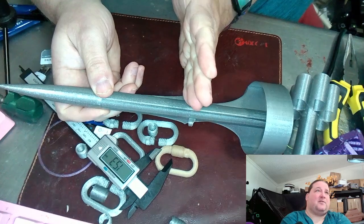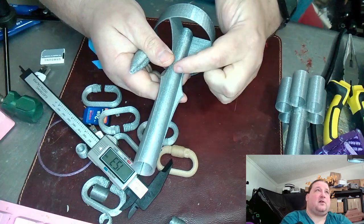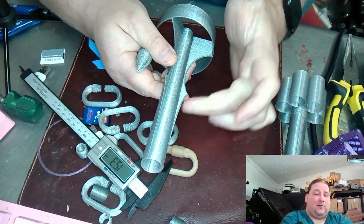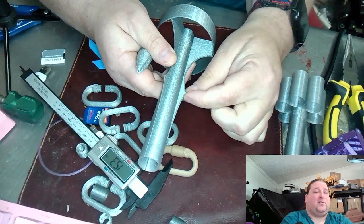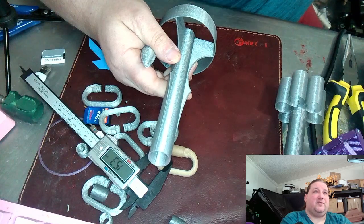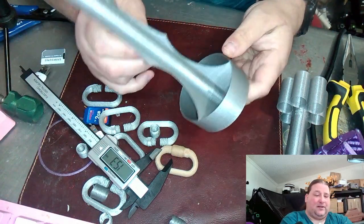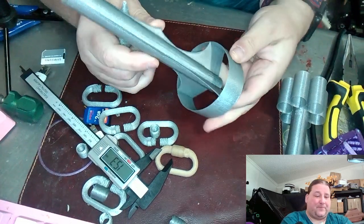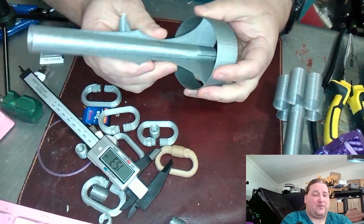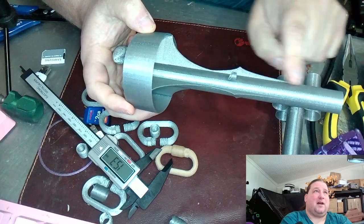That's going to be a 1.2-meter-tall version of this at 400% scale, split in half — 400mm each — and the nose cone is almost 400mm. The two body parts are going to glue together with a coupler inside so they line up perfectly with almost no seam. I'm using a color transition filament so I get a nice color gradation from the bottom of the rocket all the way to the top. I'll be releasing this to my patrons soon — they get all my models for free. This is the Citadel. The small one is just two layers of plastic for a 13mm rocket, but the larger one has ribs to strengthen the whole structure.